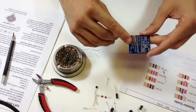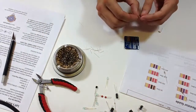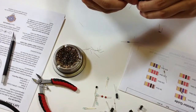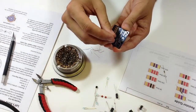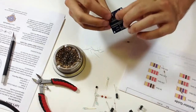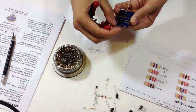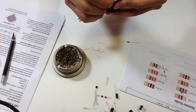This is our 220 ohm resistor — the board is labeled '220' so you'll know where to put it. There are two 220 points on the board; slide one in, push the leads away from the IC, then put the other 220 right underneath the diode and push that one away in the opposite direction. If you press the leads down too far they'll be difficult to snip later.